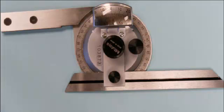This is a universal bevel protractor, often referred to as a vernier protractor, and its purpose is to measure angles. There are several different parts to this universal bevel protractor. What we have here is the base that the measurement is taken from. It also acts as an area for an acute angle attachment tool to be added to, which I'll show you in another photo. Down here we have the blade, which is actually inserted through a groove and tightened with this nut here. It will articulate around the protractor and allow you to measure the angle against the base.